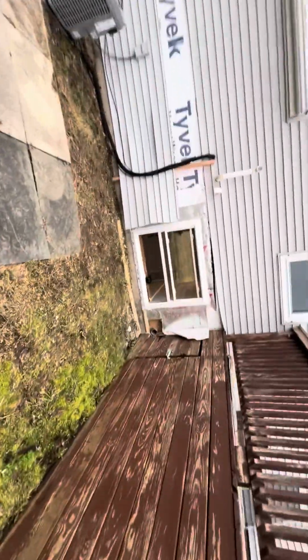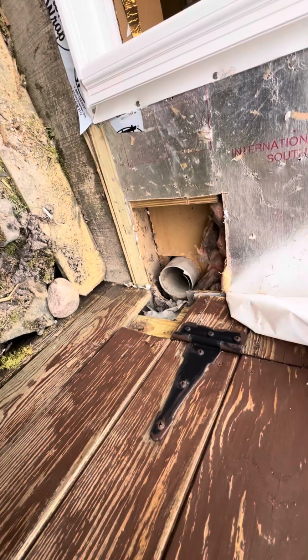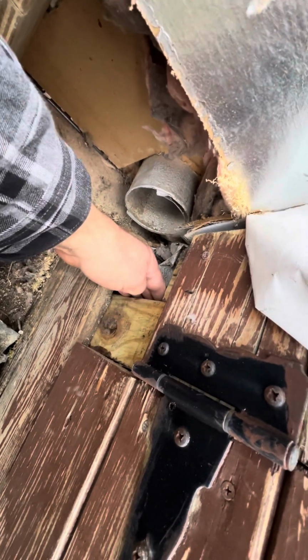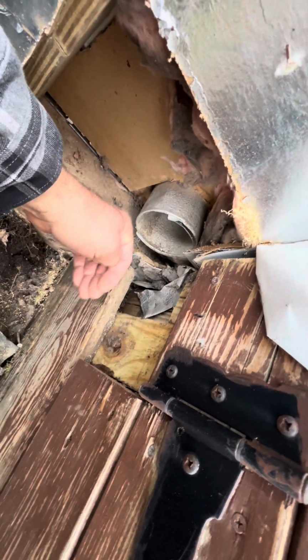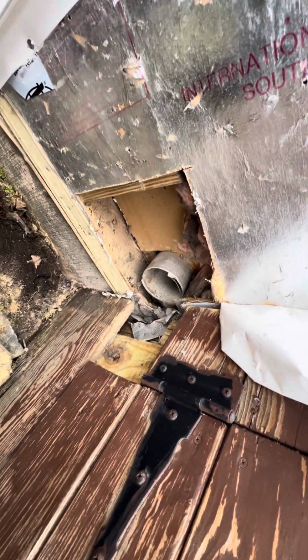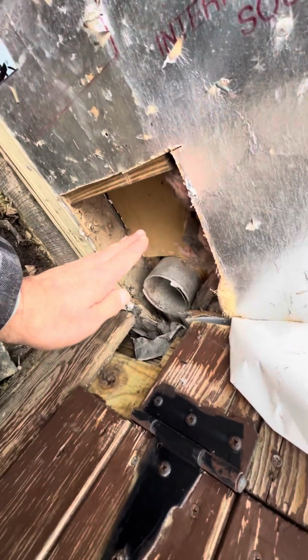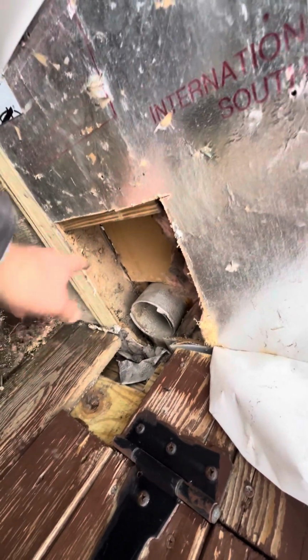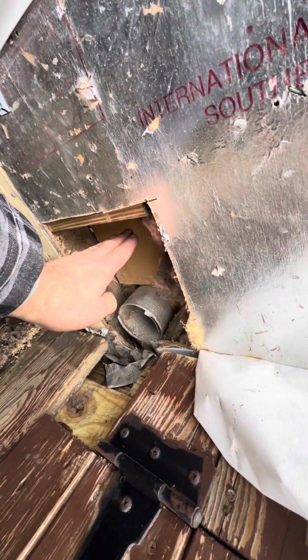Then here on this guy, I might have taken a picture of this yesterday, but that's your dryer vent coming out there. And they had it venting halfway in here and halfway out. Needless to say, it was all clogged up. So we're gonna put a fresh one in. We're gonna move this thing out here, do the same kind of thing. We're gonna put some 1/2 inch plywood here, drill a fresh hole, slide that thing over, and then have to patch that inside hole as well.